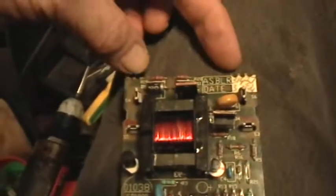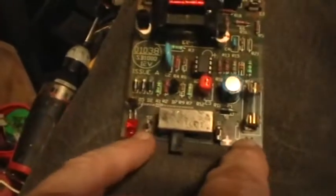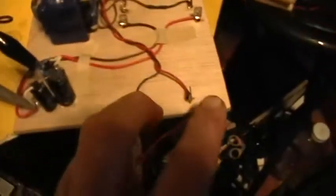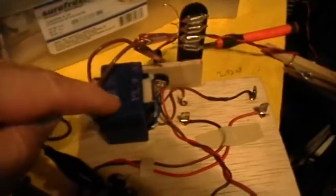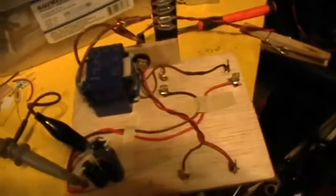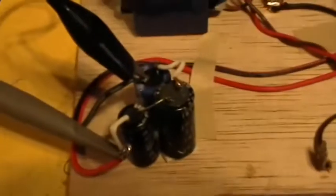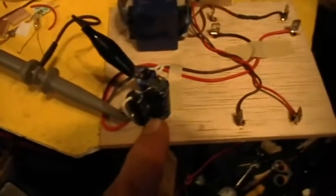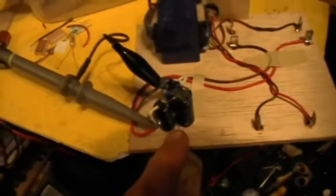It has these nice little connectors for the output high voltage transformer that drives the fence, the reservoir capacitor that discharges into that transformer, and the DC input. So I made a little snap-in board for it with those functions on spade lug connectors. And for testing purposes, I found a 10-to-1 transformer, with one side hooked to the output of the board and the 10 side hooked to my NE2 neon load bank. I also made up a capacitor to match the spec, which is 7.5 microfarads at 900 volts — so there's about an 8.5 microfarad capacitor there, and a scope probe.